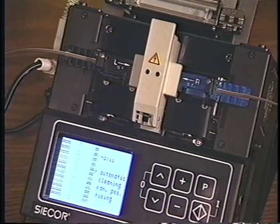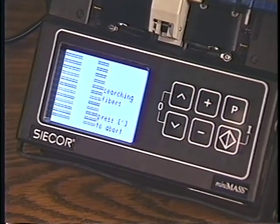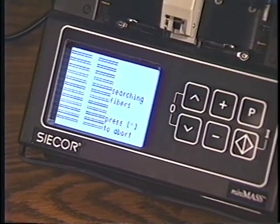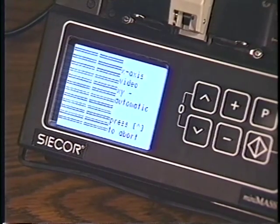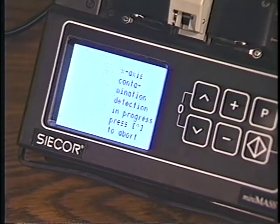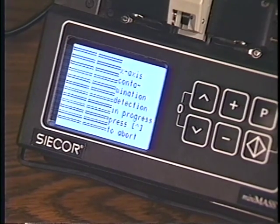So, your number one fiber at the bottom of the handler is displayed as the number one fiber at the top of the screen. Press the Enter key and you will see the fibers move toward the center of the screen. The short cleaning arc applied to the end faces will vaporize any residue. The splicer will proceed by checking the cleave quality and alignment of the fibers.